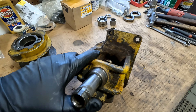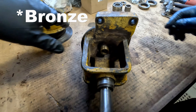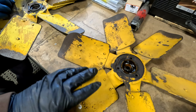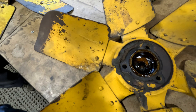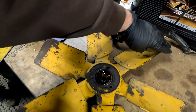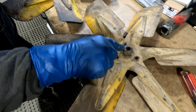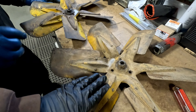We're talking about protecting everything before sandblasting, especially the brass since it's soft. We're also picking a fan — you can always tell 7J ones by the bright yellow paint; the 4G stuff has the old factory yellow, similar to highway yellow. We definitely have a gasket to make there. The 7J fan blades are a little more nicked up — same part number — but the 4G one looks a lot better with its machined surface still intact. We'll use 4G's original fan.